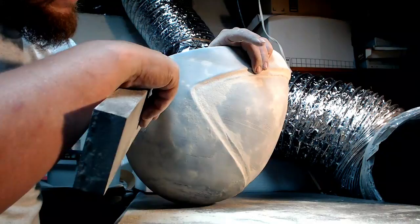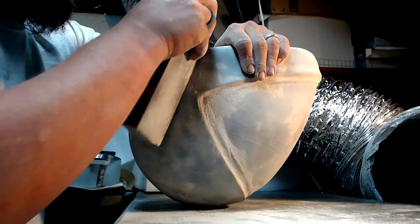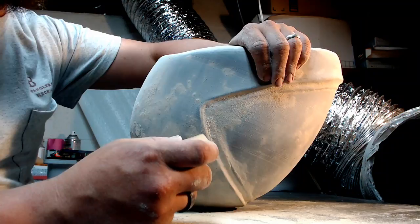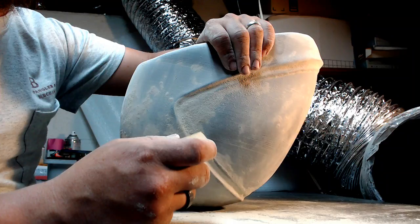You can feel the layer lines a little bit, but they're not like they were originally when it came off the print bed. The other thing is, too, this was printed at 0.2 millimeter layer with a 0.4 nozzle. I still have yet to put a bigger nozzle on my CR10. The thing prints so well with a 0.4 nozzle that I'm sort of afraid to screw it up. I know how to fix it if I do, but I got the idea, don't mess with it if it works, in the back of my head.